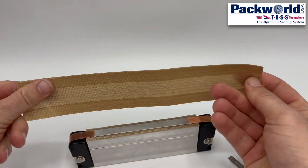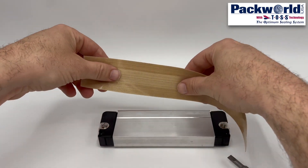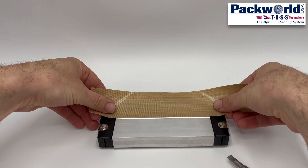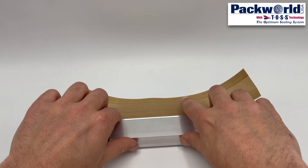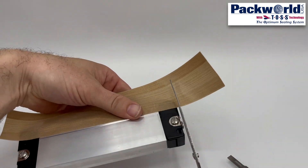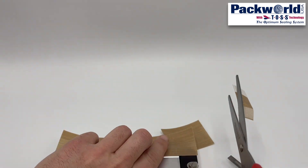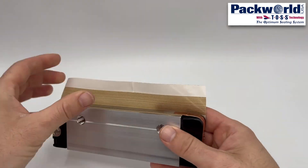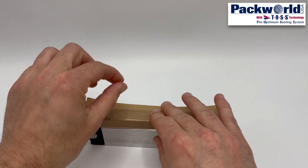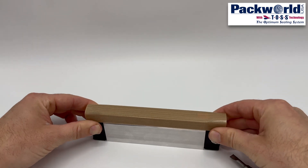The final step is installing tape over top of the heat seal band. A line in the jaw bar marks the bottom of the water cooling channel and can be used as a guide to align the tape. Ensure no adhesive touches the heat seal band. Excess material can be trimmed to fit the jaw bar, and the tape can be wrapped around the jaw bar and adhered to the other side. Wrapping the tape tightly is not necessary — just be sure no wrinkles are present.